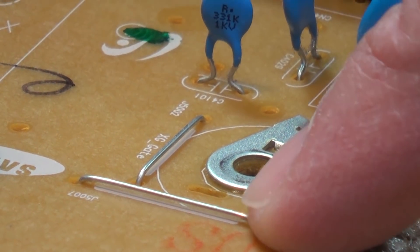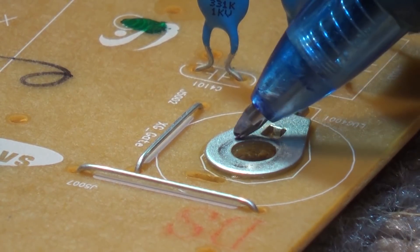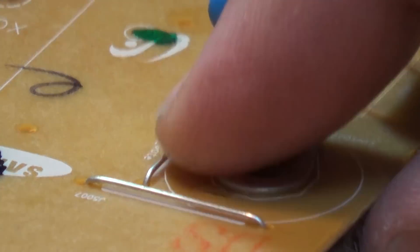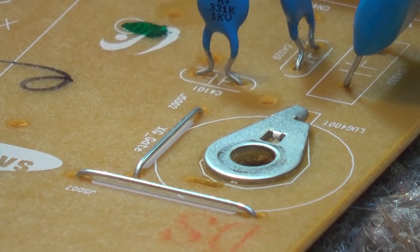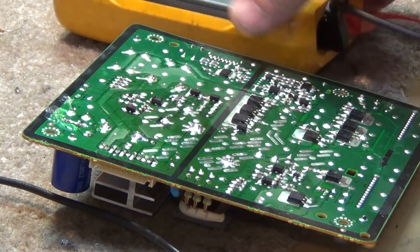That caused a grounding fault, which would have caused a power surge — much like on the Panasonic that I repaired a while back that had failed components on the common modes, which is the same as the X main. So let's see what has failed. Let's start out by measuring some transistors and diodes.